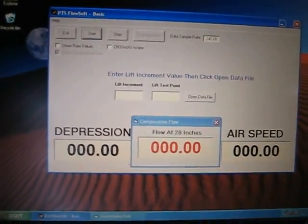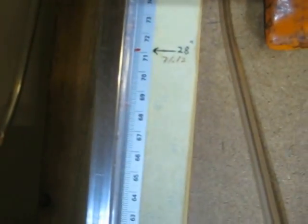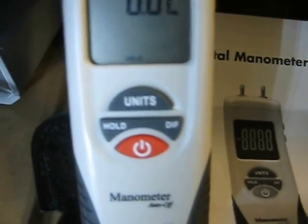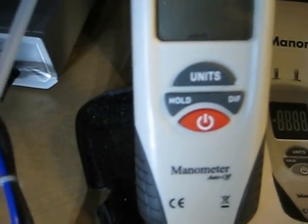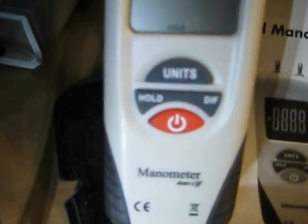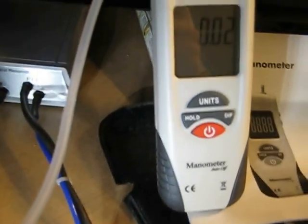I'm comparing it to my PTS calibration equipment, and over here I've also put in parallel a water manometer with a scale up to 28 inches, zeroed at the bottom. The bench is a mess because I'm in renovation, so forgive the clutter. We're working in units of inches of water — the digital manometer has about 12 or 14 unit options you can select: bar, millibars, inches of water, feet of water, centimeters of water, and more. Right now I'm in inches of water.